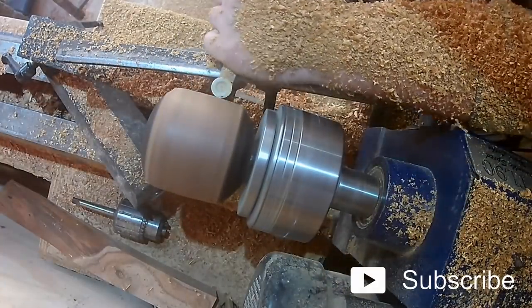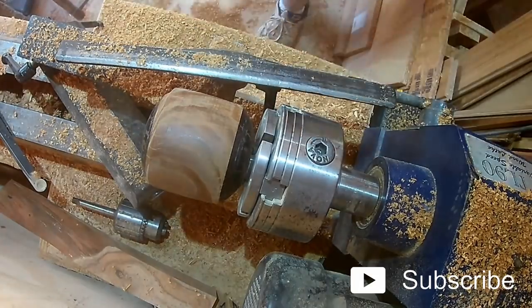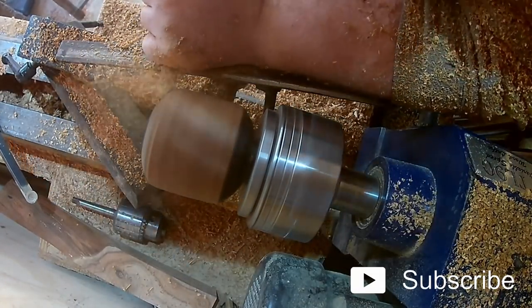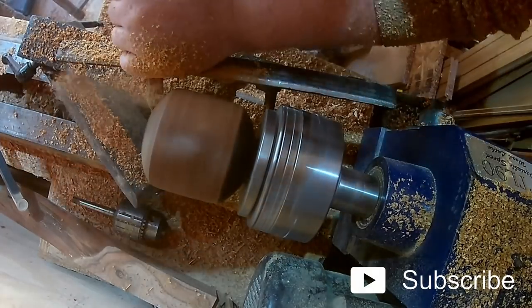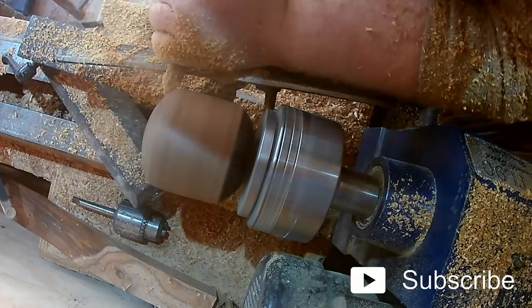I wanted to be careful not to cause any cracks in the wood to open up any further. I found the end grain to be the hardest, and I had a catch after catch, so I ended up using my triangle carbide bit, and that worked a treat, and gave a great look and feel to the wood.